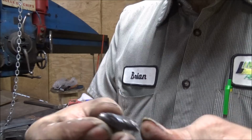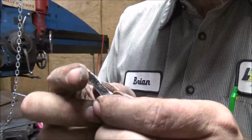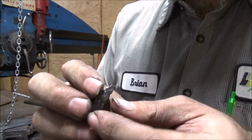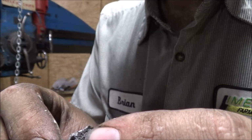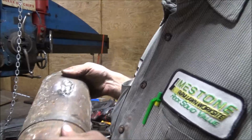Here's a fractured out weld nugget. You can see the cast on both sides. Looks like a decent job. Don't see any porosity in the weld really. Clean this off and I want to do the bend brake test on it, the one run with no flux.